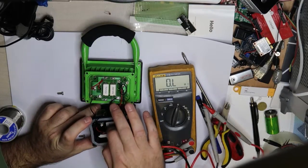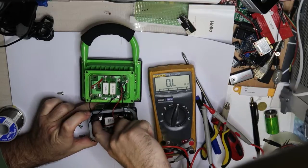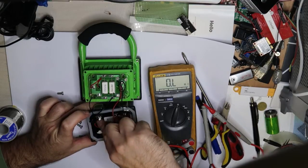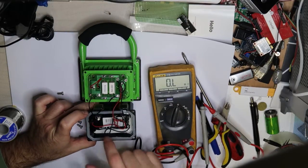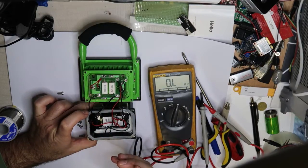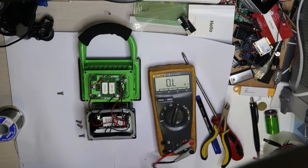I'm pretty curious whether the battery has any protection circuit. When I touch it I don't feel any PCB inside the plastic, so I bet there is no protection inside and that the protection is on the power supply itself — limiting the voltage. Also, it has only 2 wires input, and if I have 7.2 volts I should have at least 3 wires if the circuit was external. Anyway, let's now check the power of the LED.